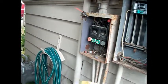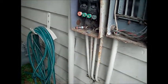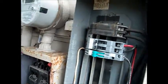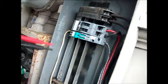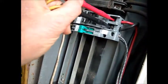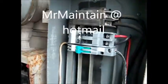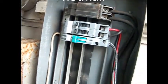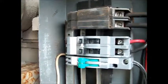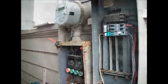I use one of these testers. They put a slight draw on the line. Basically, we want to go across the black and the red and show 220 volts here. If we look at the meter, we see that there are 220 volts coming out of that. That was our original problem — we didn't have 220; we had voltage on only one leg. Mystery solved.